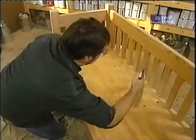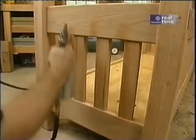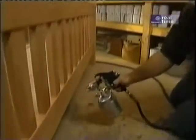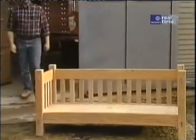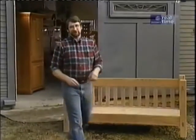When it came time to apply the finish to my sofa, I could have used a brush, but it would have taken a long time to go around all the slats. So I chose to use my home sprayer. The product is a water-soluble polyurethane — very hard, and because it dries quickly I can put on four or five coats in about an hour and a half. It's non-toxic, but I do wear a mask to protect me from the mist. Best of all, I can clean the whole sprayer up in just a few minutes with soap and water. Now all I need to complete this project are the cushions, and they're on the way.